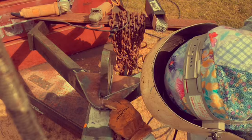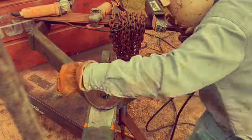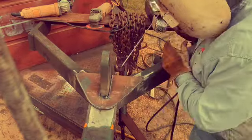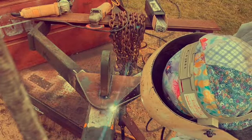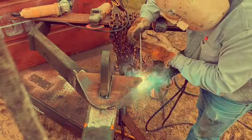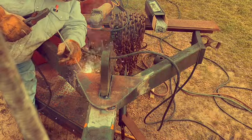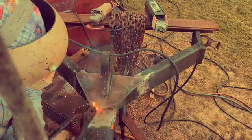So, finna lay down some of that 70-18. Oh, sorry, that's 60-10. Yep, that's 5P plus. That's the gray rod. Y'all, this little Bobcat 225, it will eat them 60-10s. It loves that 5P plus rod. Sometimes it gets a little finicky restarting some 70-18, especially Excalibur 70-18, which is kind of odd because Excaliburs usually restart very well. But this little Bobcat, man, it loves those 60-10s.